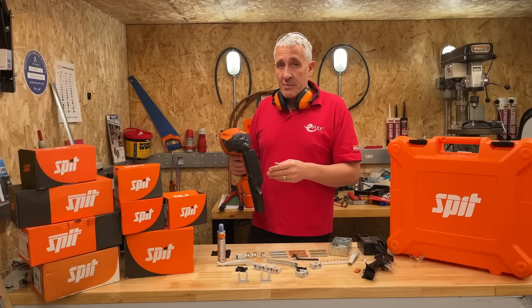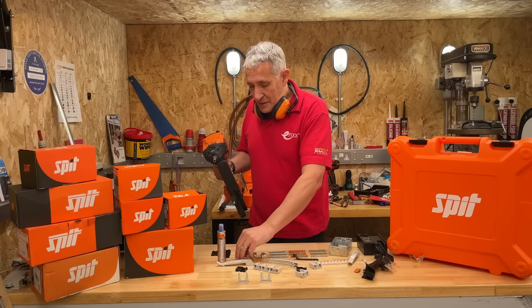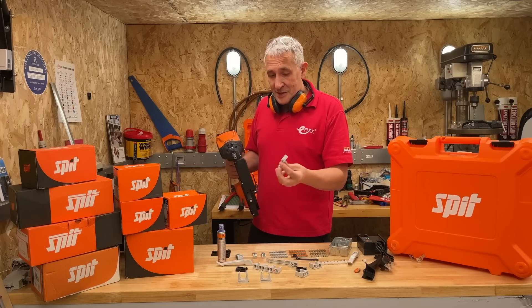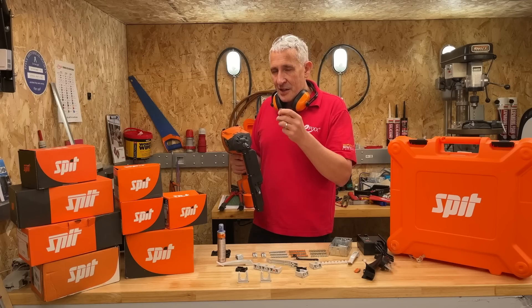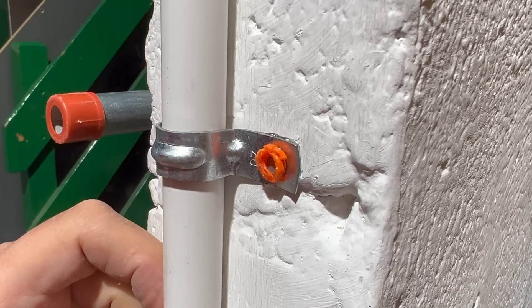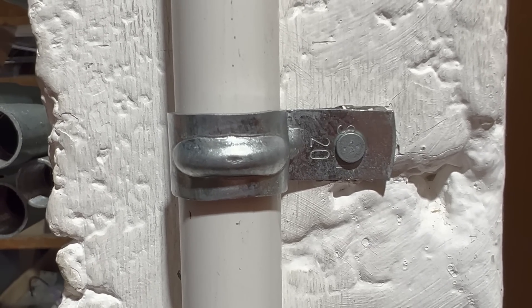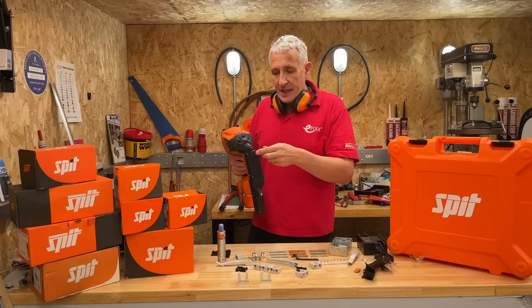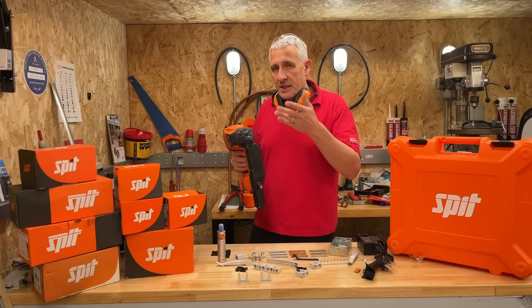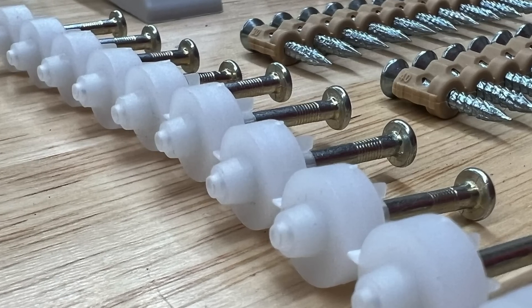A lot of the time we have to think about premature collapse of cables, so therefore we need to use metal fixings. The amazing thing about this tool is that here's a steel conduit P-clip from Spit — it actually fires through the steel, so there's no actual fixing hole in it. You can get a magnetic accessory as an alternative barrel for this machine that holds it in place so you can keep single-handed operation.